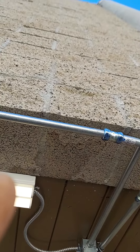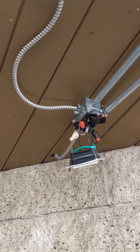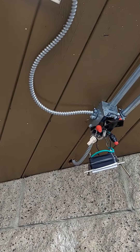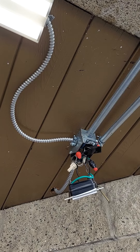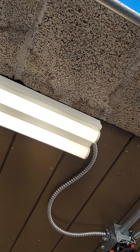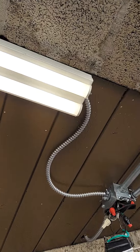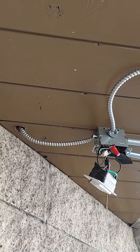They have one rain-tight coupling right here, then a compression fitting, going to this contraption — this is for inside the wall, this is for an old-work single-gang box, and this is all outside. They could have used a single-gang weatherproof box, or I would have gone with a two-gang weatherproof box so you have the room you need. They also have MC cable on the outside going in, which you're not supposed to have — it should have been liquid-tight or regular EMT for this light. Then they have MC coming out right here into the box itself, which is wrong, and that's the wrong type of connector for MC cable.